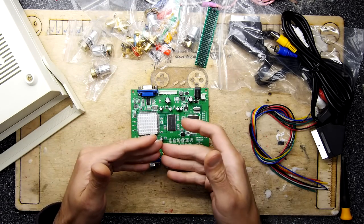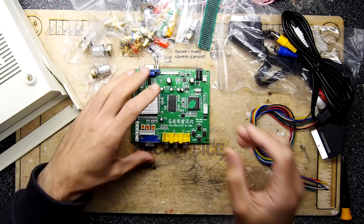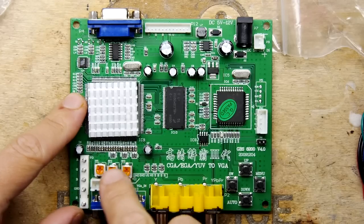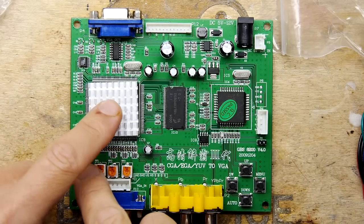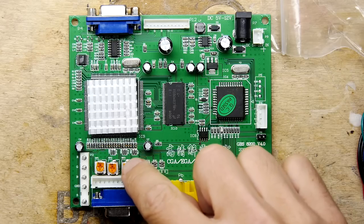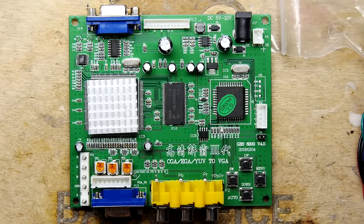The first thing to do in this project is to remove all of the pieces from this board that I don't want anymore. That's the variable resistors here - and that's because we're going to be using our pots instead. These are 500 ohm resistors and our potentiometers are 1k or thereabouts, so not too bad, we can work with that.